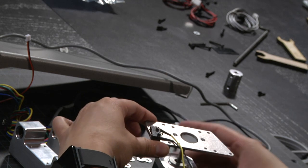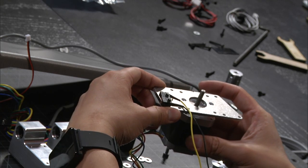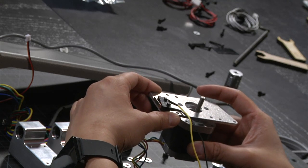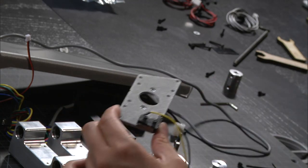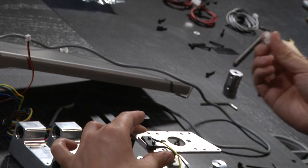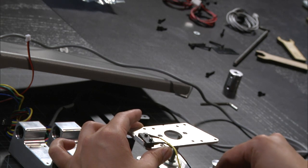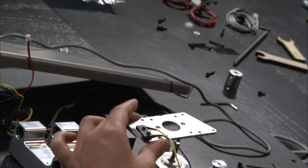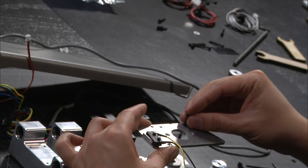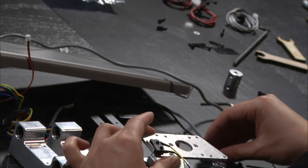What's going on, Norm? Figure out the distance right now. Are you back on 17? I'm still on 16. Yes. Okay, so look at how, see. I need those M3 22s. You need to put the tensioners on. This is why you're going backwards. The tensioners are those bearings. You have them. Yep. And they go in with the M3 22s into those big holes on either side. But there are only two of them. There are two of them. That's okay. So I need the M3 22s. You have them. They're the big fat ones. Sorry, it's not them. It's the M4 12s. It's the big fat ones. Put the bearings on the board.